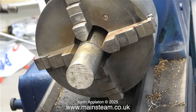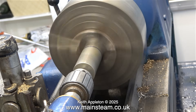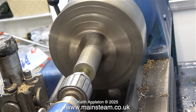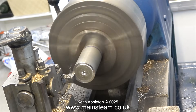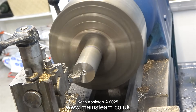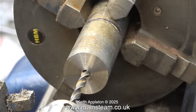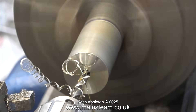I need to drill a hole all the way through this piece of bar, and as always I'm starting off by using a centre drill. This is not really a precision part — it's going to be a very strong part. It's to hold the seatbelt a little bit higher, because when I fit the seatbelt to myself in the Land Rover it's too low and it clamps my arm. The Series 2A Land Rover from 1971 did not have power steering, so I need all the strength in my arms I can muster. Once I've drilled all the way through I will part it off into two pieces, but first I'd like to show you the drilling technique.